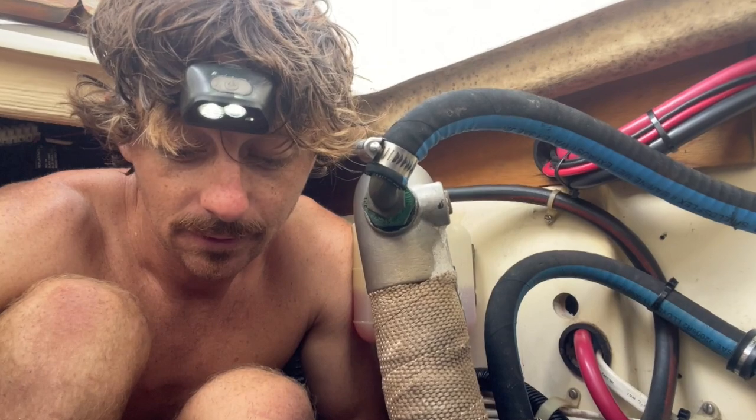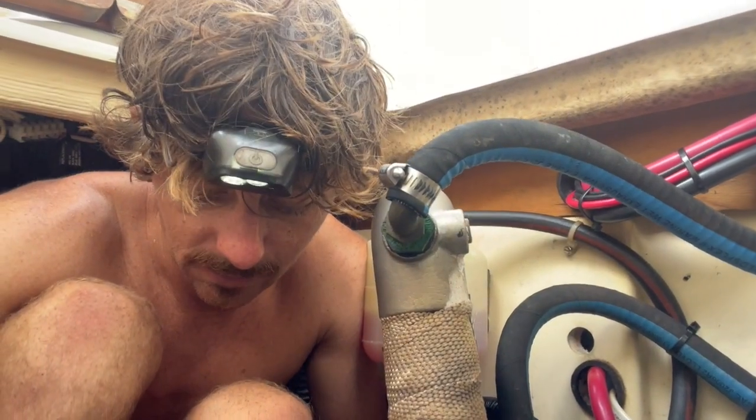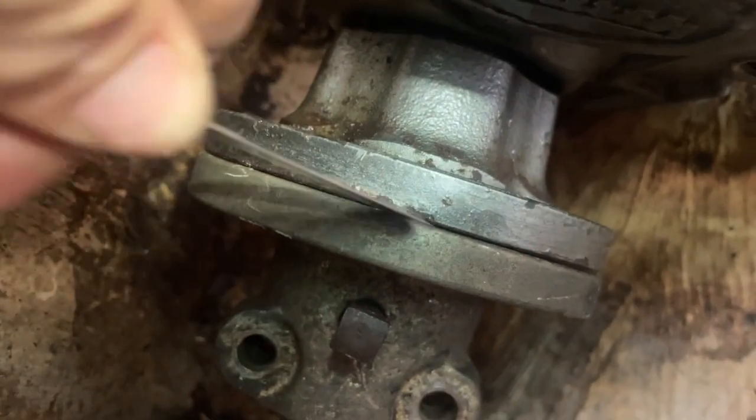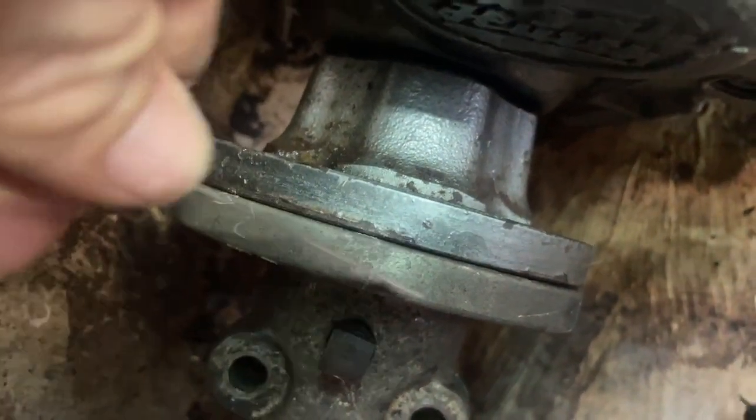So all right, I'm going to go ahead and play with my little feeler gauge, using this guy right here, which is definitely one of the thicker ones. I can't shove it in this crack at all, right? But down below I can actually slide it right in. It's hard to see, but it's actually inside there. So that means I've got an opening at the bottom, and it's pinching right now at the top, right? So I need to get it the same all the way around.